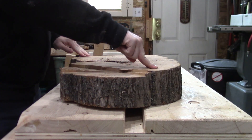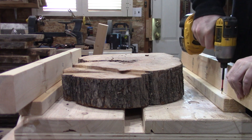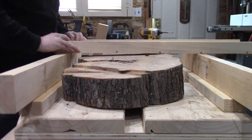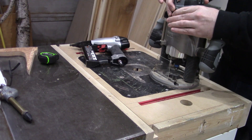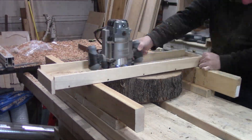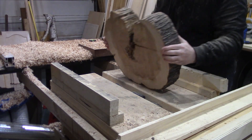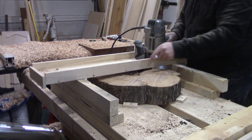This cookie is nowhere near flat so I will need to flatten it. I set up some rails on the sides of my workbench out of some scrap 2x3s and 2x4s. Luckily I still had my router flattening jig, which I made in a previous video. I pulled my big router out of the router table and threw it into the plunge base. I decided to go with a ¾ inch straight cutting bit since it was what I had, and then I could start the very messy process of flattening this cookie. Once I had the first rough pass done, I flipped it around and using some scrap plywood and some screws, I locked the cookie into place and continued flattening the second side.